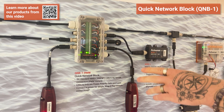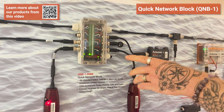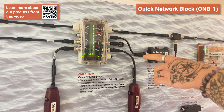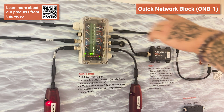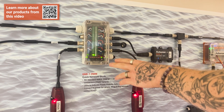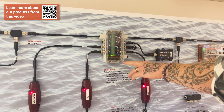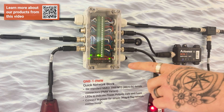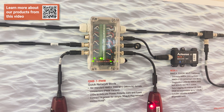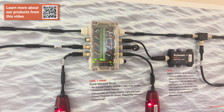In the middle of the network, the QMB is providing power to the network through the 12-volt supply connected at the back, and then we're powering the left and right sides of the backbone independently. On the QMB we've got two fuses — one for the left side, one for the right side. There are four-amp fuses in here, but they can be replaced with up to eight-amp fuses if we're using the thicker mini cable.